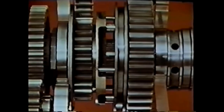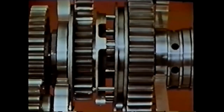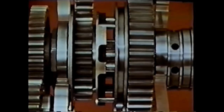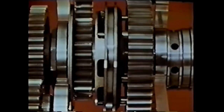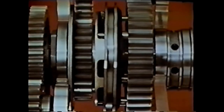Shifting in the auxiliary is also done by a sliding clutch — you can see the groove where the shift fork fits. But the shifting action is somewhat different because a new element has been added: this clutch utilizes a mechanical synchronizer to match output shaft speed to main shaft speed before shifting — an operation which in the main transmission is controlled by the skill of the driver.